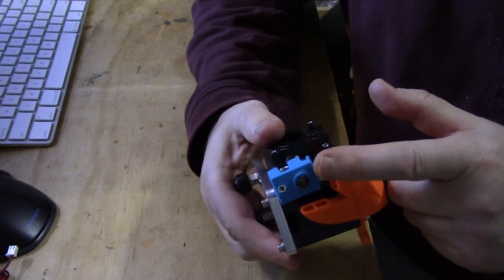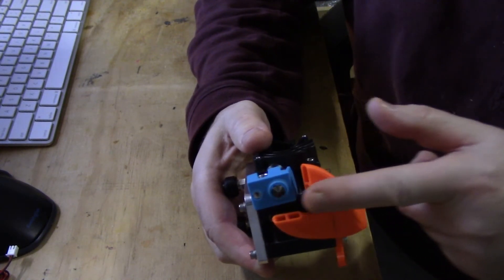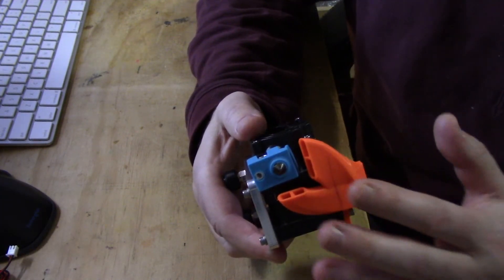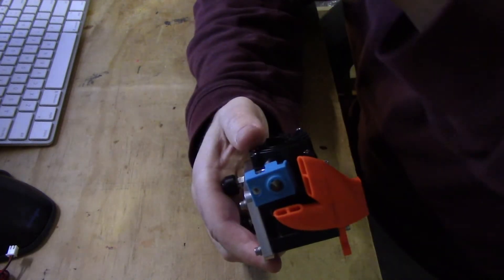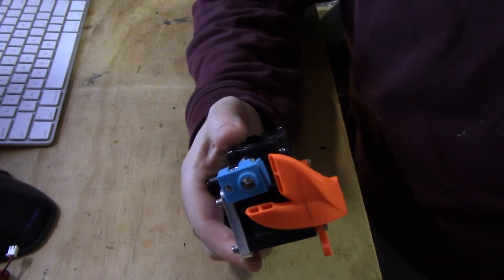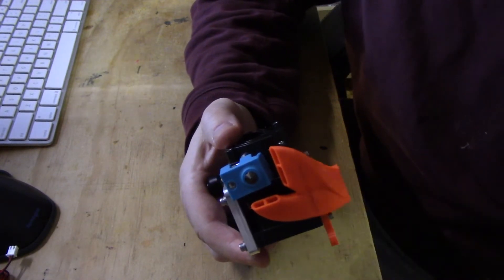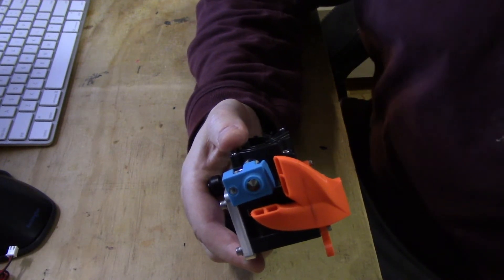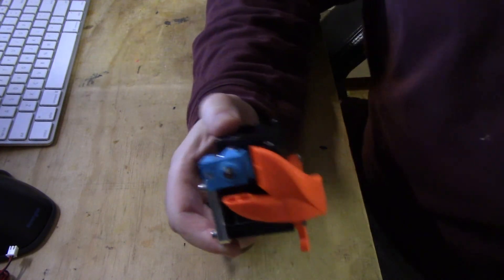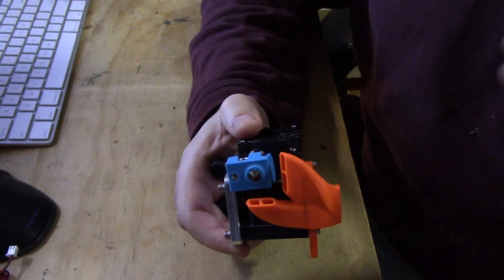The big thing is the way it goes across the nozzle. With the nozzle flipped, I can now bring this duct closer — just a little bit off the bed so I have better visuals — but it also brings it closer and makes it so it's going right across the nozzle itself. Plus, I have another one coming in from another angle. Between the two, the air hits the part and the heat is dragged away. You can do the fang-style ones where you come from both sides, but the problem is the air just swirls around in front of the nozzle. I'm no fluid dynamics engineer — I'm just going with what looks like common sense. I like this idea better, and it seems to work really well. The reason for flipping the nozzle is to get this duct closer to the nozzle and point it directly at the nozzle instead of just flooding the area with air.